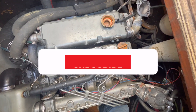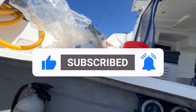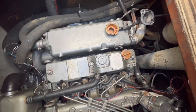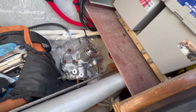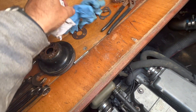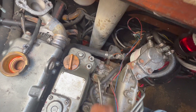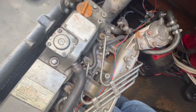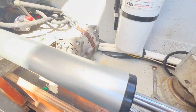It's Sunday and it's a lot quieter here — there was a bunch of guys rigging this lagoon the other day so I decided not to do a video. But I'm back over here putting a water pump on — brand new water pump. Had to take the pulley off and everything else. The thermostat gaskets are right at the front of the engine, so just behind this it's virtually impossible to get to. Did most of it basically blind. So brand new alternator — there's the old one right there.